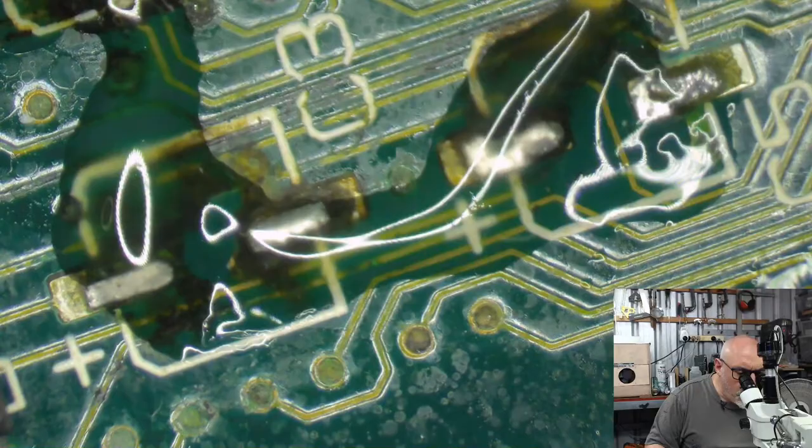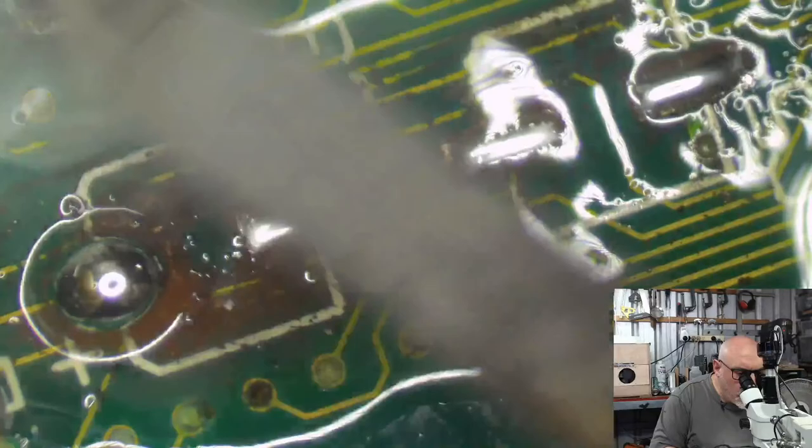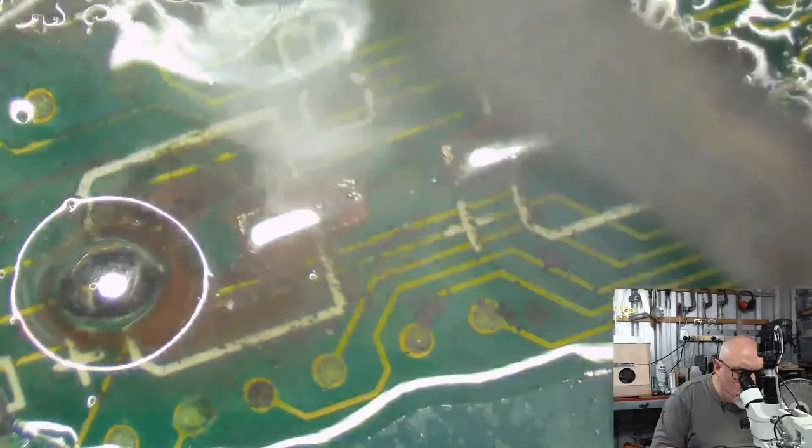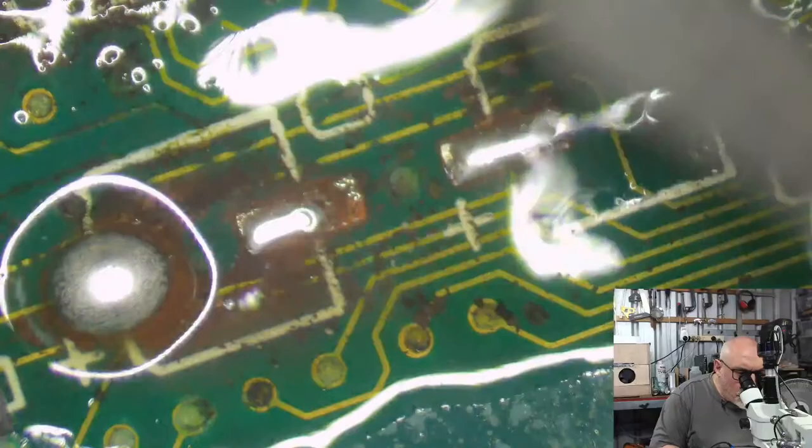And so sometimes if there's a break on the... Oh, let's not put that there. So if some of the mask has come off the top of some of these traces, and then you accidentally put the tantalum down that has the wider pin, and it touches a little bit of exposed trace that's running underneath it, you can sometimes create a short. I've done it.